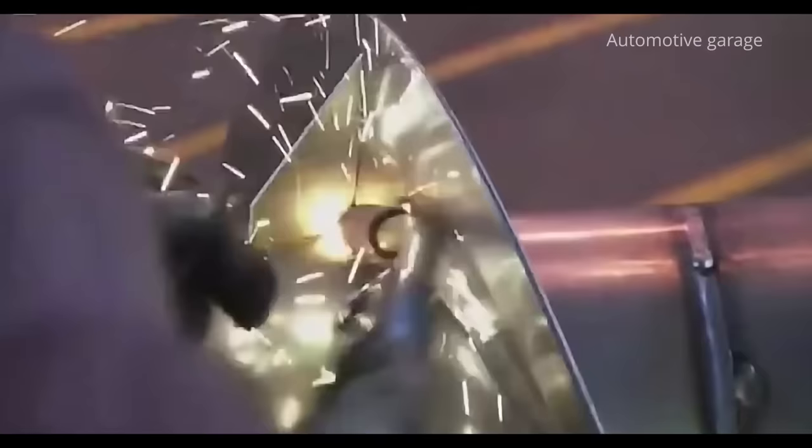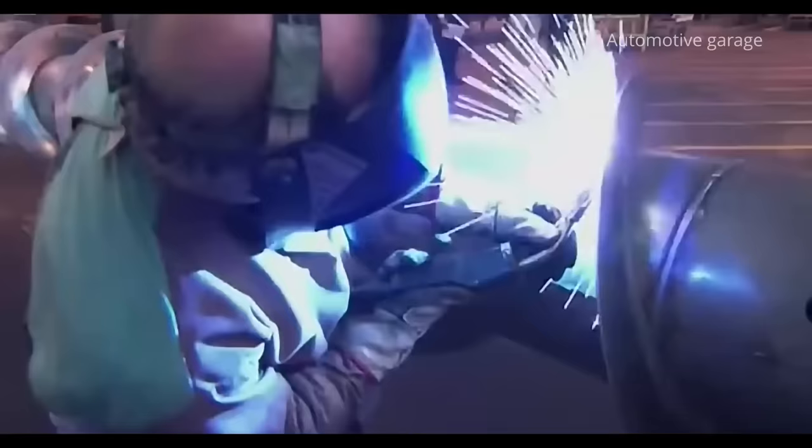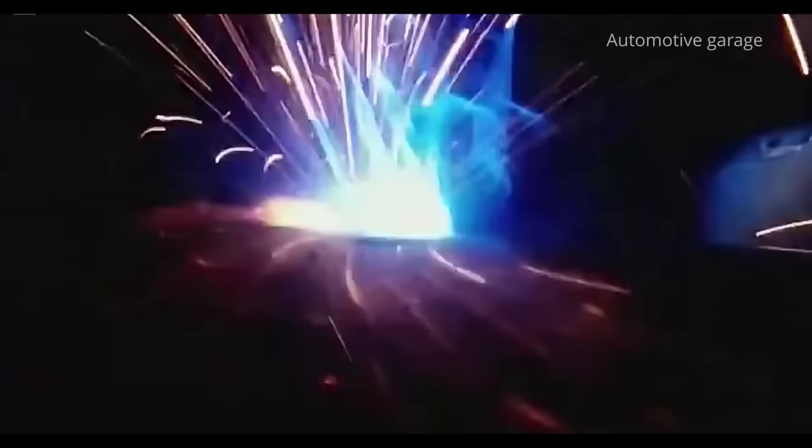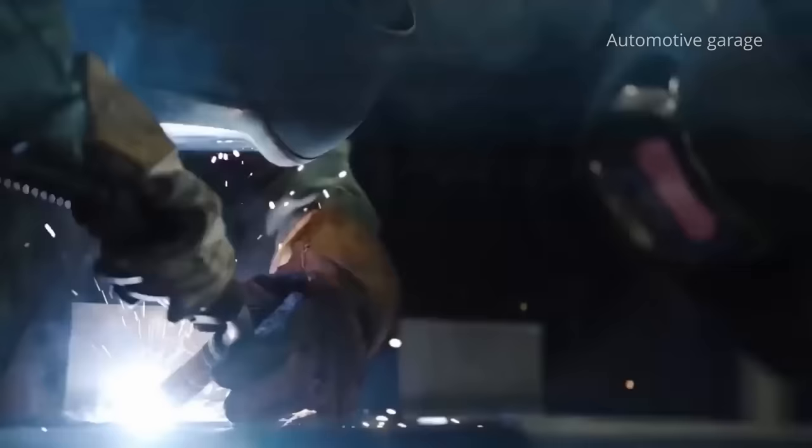Everything starts with a machine that makes cylinders with a diameter of 66 centimeters from three sheets of steel. Then welders weld the cylinders together, obtaining a shaft 11 meters long. After that, they attach a spiral blade to its surface with the help of 92 wedges.